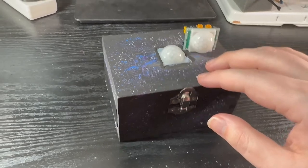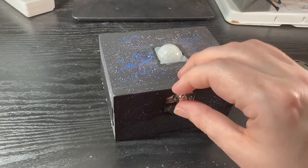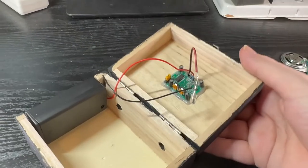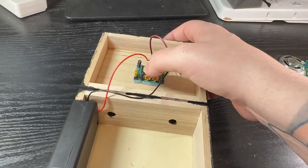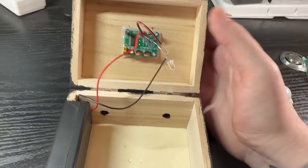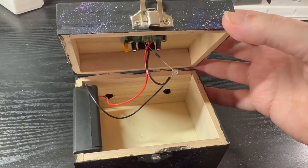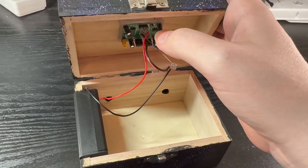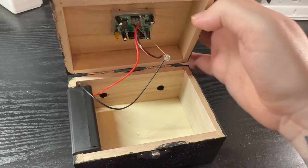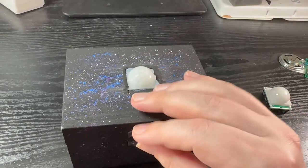Those are my settings — if you're going to make one, just play around and see what you like. The important thing is to make sure your settings are right before fixing everything into the box, because it's now held in with hot glue and you can't get a screwdriver in to adjust it. Just wire it up — it's a pretty simple circuit. You've got a resistor — I'll put links in the description with the resistor value — and just a white LED. You ideally want a white one because colours may not trigger the music box as effectively.